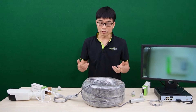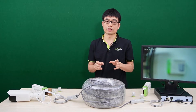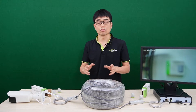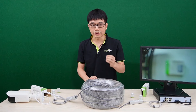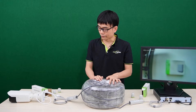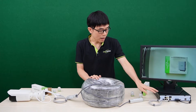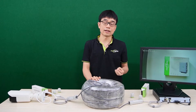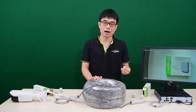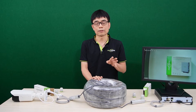One more thing about the power budget. When we designed this PoE NVR, it was supposed to be used at about 328 feet. Now we are extending the whole system up to 1,000 feet — about three times the regular distance. If the power budget is not enough, it's still okay for a small camera. But if you're using a PTZ zoom camera, the power budget from a single port may not be enough. In that case, you can use a PoE++ injector which can output 60W or 90W, and that will solve the power budget issue.